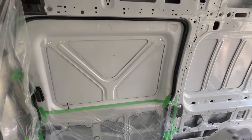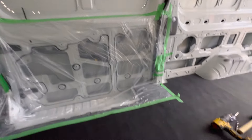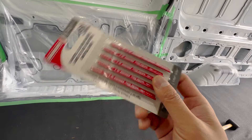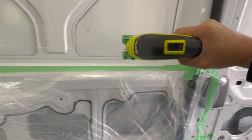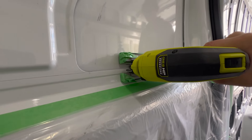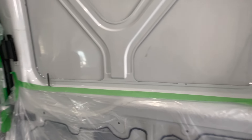Now it's time to jigsaw this. I've got the jigsaw and put some painters tape on it so it won't scuff up the paint on the inside. I'm using these jigsaw blades that are 30 TPI — teeth per inch — so the finer the blade, the cleaner the cut. Before I start, I just wanted to show that this lip it's resting on actually makes a pretty decent guide to travel along where we need to. For all the straight cuts this will work pretty good, and the prep we did for the outside cuts hopefully should come in handy.